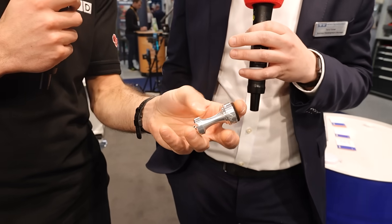What's amazing is on aluminium, on such a small diameter, you're getting a really nice finish. You've obviously got a decent RPM that can get up to the cutting speeds you need. Yeah, so it's 1,500 RPM on this one, and on the smaller machine it's 2,000 RPM on the turning.